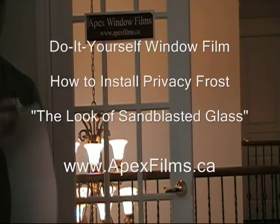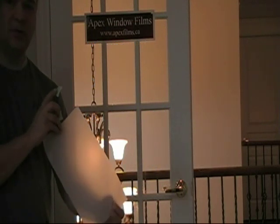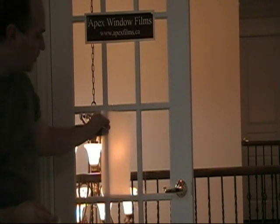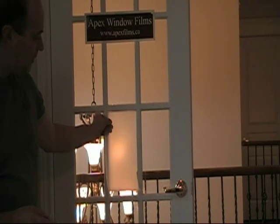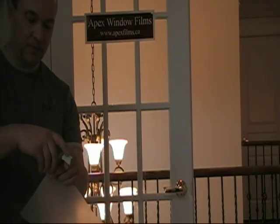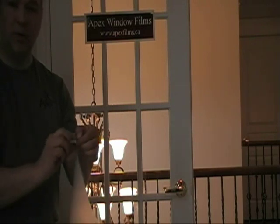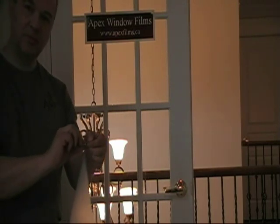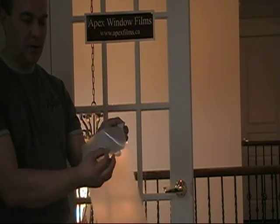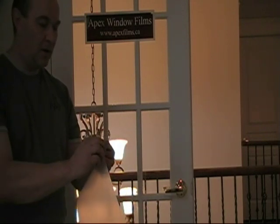In this lesson we're going to show you how to put up a small piece of frosted film. This is our Apex Classic sandblasted film, we're going to put it on this side just like that. A little trick when taking the liner off the film: a couple pieces of masking tape work really well, one on the back and one on the front. After a couple tries, that's going to reveal the sticky side and make it really easy to pull off.